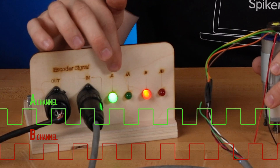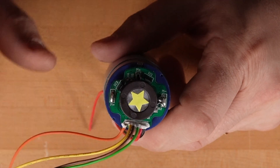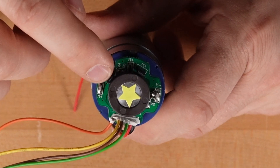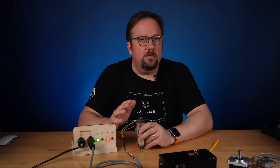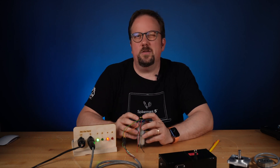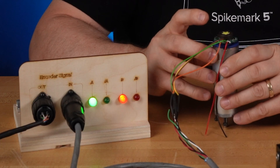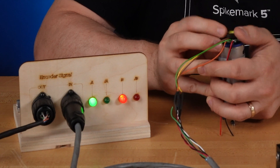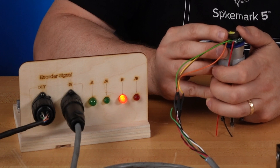To show you how this works, I've got an encoder here with a very coarse resolution of just 24 PPR. Instead of using a light beam like an optical encoder, it uses hall effect sensors and magnets embedded in a disc to generate the pulse. The method doesn't matter — it's still an incremental encoder that spews out a stream of pulses when it turns. I like using it to demonstrate because the resolution is so low that you can actually see the pulses being generated as the wheel spins. I've got the A and B channels wired up to some jumbo LEDs, and if I move the wheel quickly, it almost looks like those lights stay on constantly.